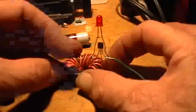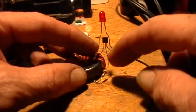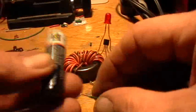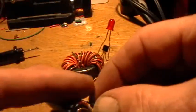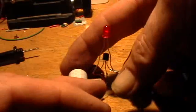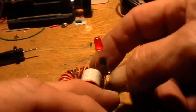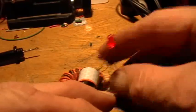So that's where the positive of the battery goes. That's the anode of the LED, that's the cathode of the LED. If I just take the same battery and touch it to the anode of the LED, you can see that the LED does not light. But if I touch it to the joule thief terminal — the coil terminal — it does light. So the battery is not capable of lighting the LED on its own.